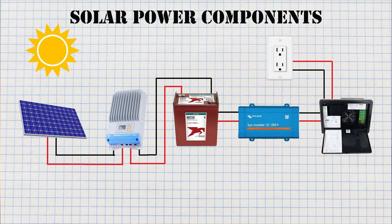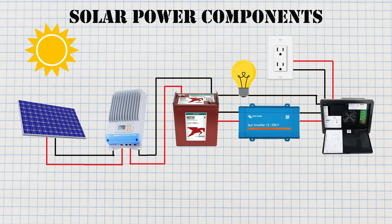In our house, we use a breaker panel designed for recreational vehicles that supports both AC breakers and DC fuses. The electricity can also flow to fuses in the panel utilizing DC power to directly power things that use direct current, like our lighting and water pumps. This is a more economical use of the power since it does not have to pass through an inverter.